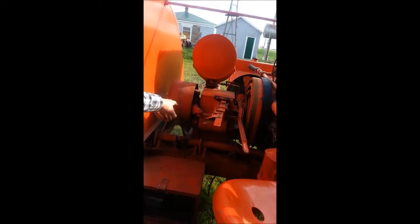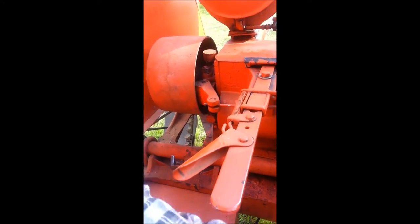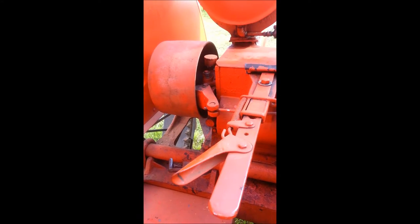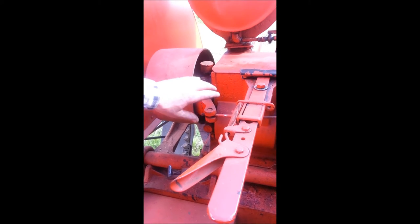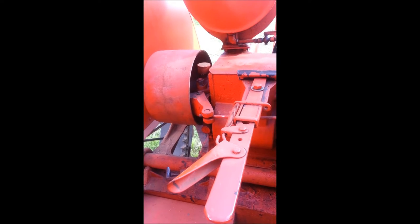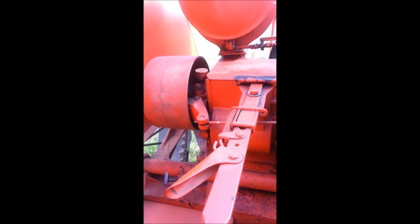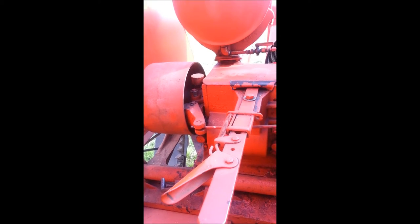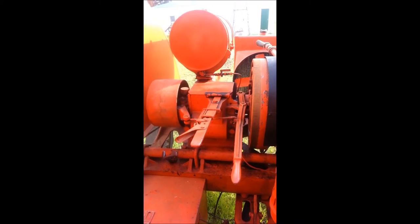You have got to have this brake hooked up and adjusted properly so that when the clutch disengages, that brake engages. Otherwise, once it's locked in, you will never get it out of gear — it'll just keep right on going if you don't have this brake right. When I'm in close quarters, I don't ever fully engage that clutch. I just kind of bump it a little bit because it's a tricky thing. If you get in tight quarters and you can't get it to disengage, you'll just go right on through the barn and keep going.